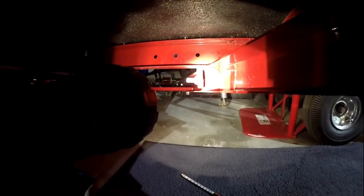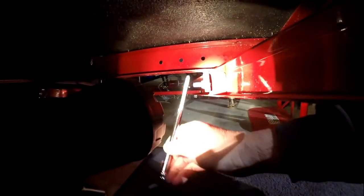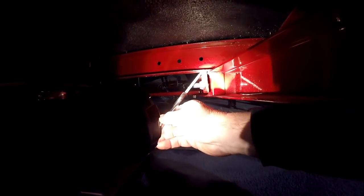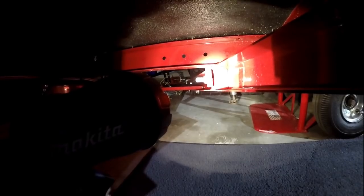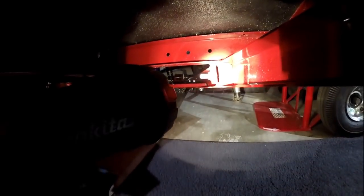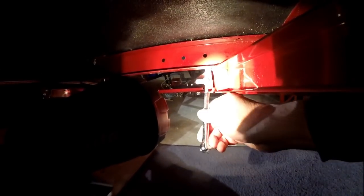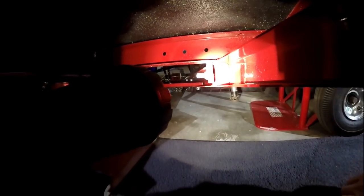The way they are now, even though they're welded, they concern me the most, because we're relying again on these factory welds. And when I had knocked off the casters off the back of the trailer, I had to grind these welds to knock the casters off the back of the trailer behind the rear tires. But I remember one of these, when I hit it, it just fell off. So I don't have a lot of confidence in these. So I'm going to take care of that issue.